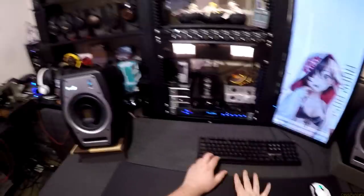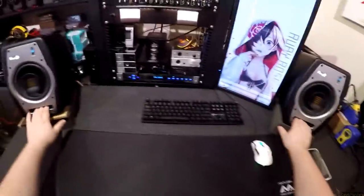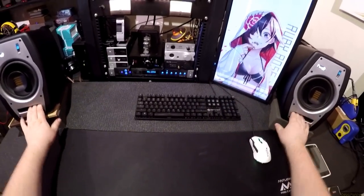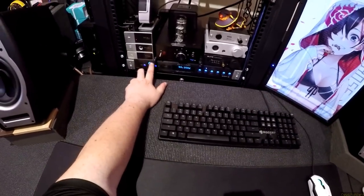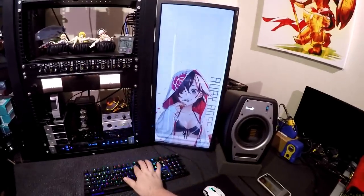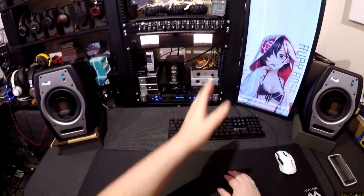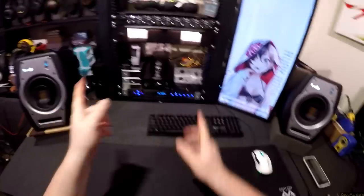However — and this could just be my pair — I put my hand in the port, get centered perfectly, measure, and everything's like: this speaker has to come down 1.5 dB. I'm pushing signal out of my Emotiva XDA-2 and controlling volume in Foobar, so I don't have a balance control. Signal is perfect out and perfect in, and when I set to mono to find my center image it's always just a little biased to one side — and I know it's that one speaker because it was the same in the living room.